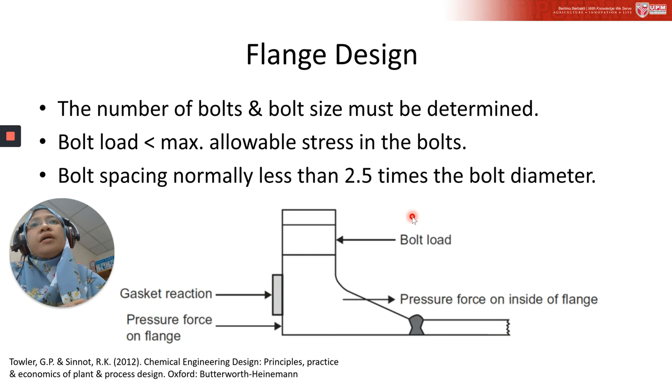Because the flange assembly and nozzle neck form an integral structure for a welding neck, while loose flanges are attached to the nozzle or pipe in such a way that they obtain no significant support from the nozzle neck and cannot be classified as integral. That is the category of loose flange. Examples of loose flange are screwed and lap joint flanges.